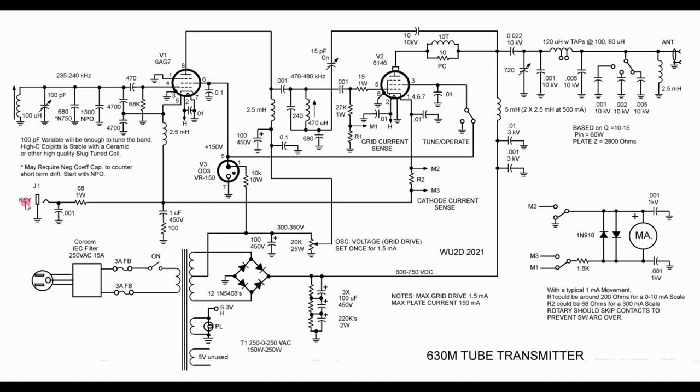The keying is a rise time and fall time control circuit. On the cathodes we have the make, which is this resistor against this capacitor, and the break, which is this resistor against this capacitor. So this is what we call shaped CW cathode keying.